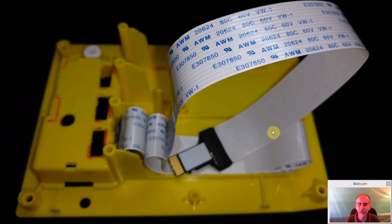So this is what I found, and it's just really long. I actually found one now that's probably a tenth the size of that length, but this one I had lying around, had it plugged in here, and what I ended up doing was this is basically a micro USB to micro USB extender cable, and when you plug this in to the Pi Zero, this added part here caused me to have to cut this out here more, because this part of the case right here will put a lot of pressure on this. It actually was not flat, it was pushing down on it like that. And it probably would have been okay, it's a PCB, it's thin, it probably could have taken the bend, but in time, stress could have cracked it.